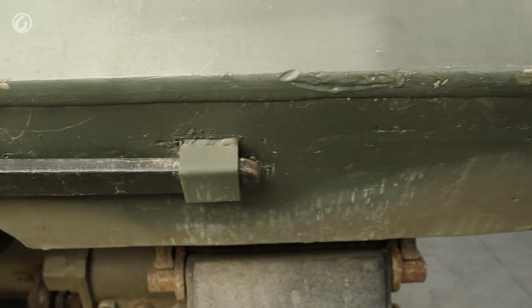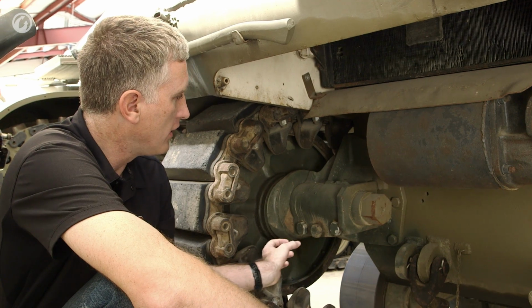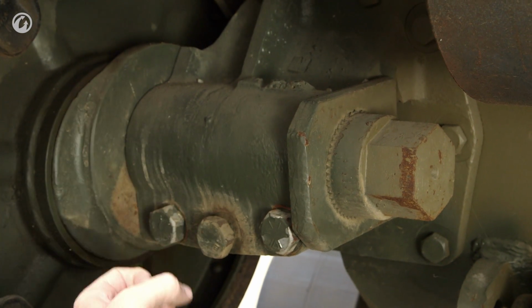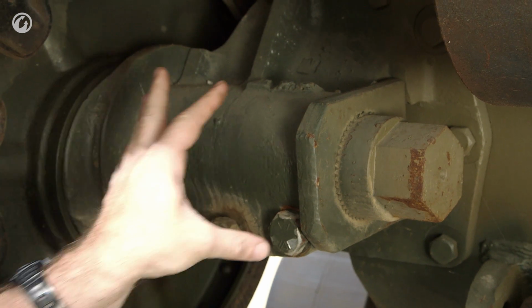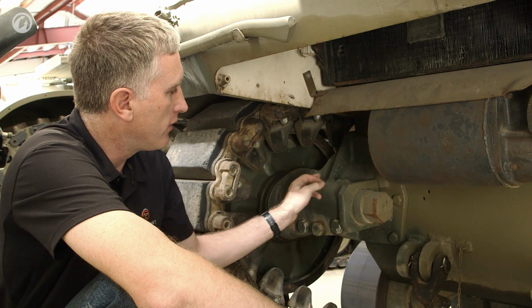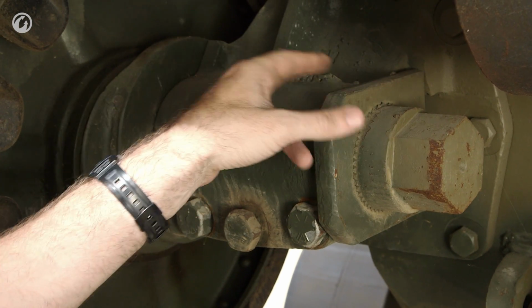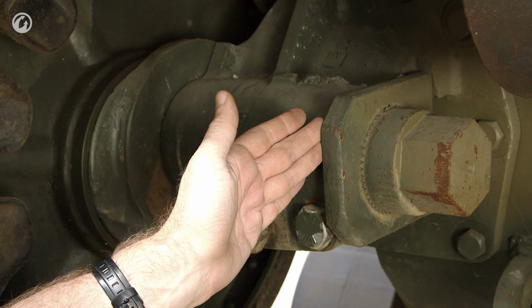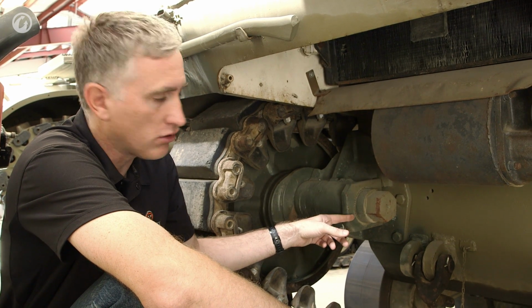Various components to be done here. Firstly, you have to unscrew these two locking bolts. You then screw in the spreader bolt, and this opens up the casing around the idler arm. These two little holes here are supposed to hold the retaining clip, which holds this locking clamp here. Knock this out of the way, it frees up the serrations.